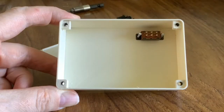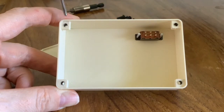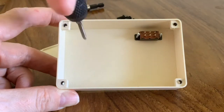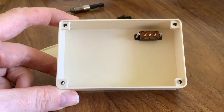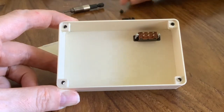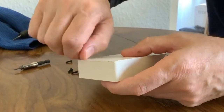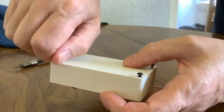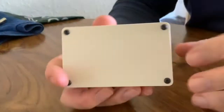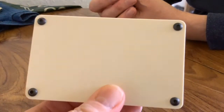So you've threaded the lugs now to take the screws. How did you do that, Paul? Well, these little plastic lugs, when they were drilled out to the right diameter, we just ran this 3mm tap through. It's only plastic, so you can turn it by hand, and it puts a thread on the inside of each lug. So that means we can now use these little machine screws to hold the lid on. Shall we try it out? Okay. Putting the lid on. That's really professional. Yeah, that's the accuracy of 3D printing.